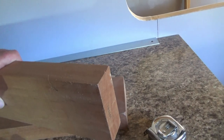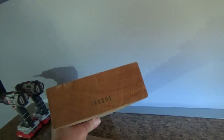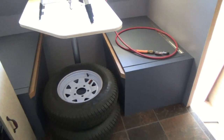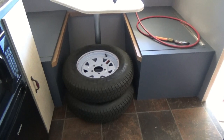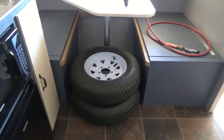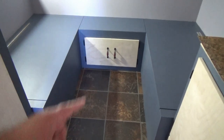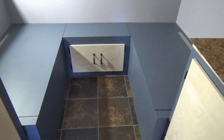From my previous old boat building days, I have some nice big chunks of mahogany left over and I'm going to rip that into inch and three-eighths pieces and then one inch wide — just like these. I like the wood; it's easy to work with and the color accents the blues and goes along with the floor. So let me get those cut and then we'll start fastening on, then we'll make our table and get it in place.